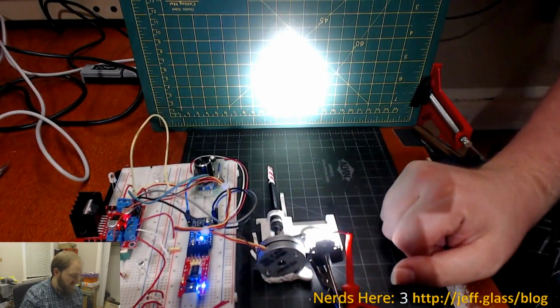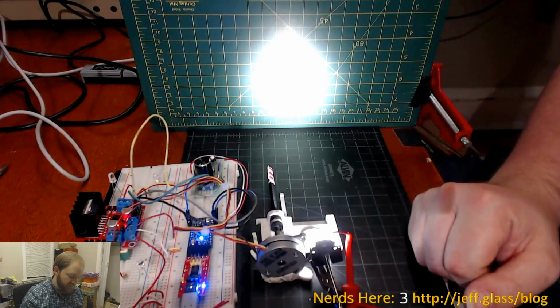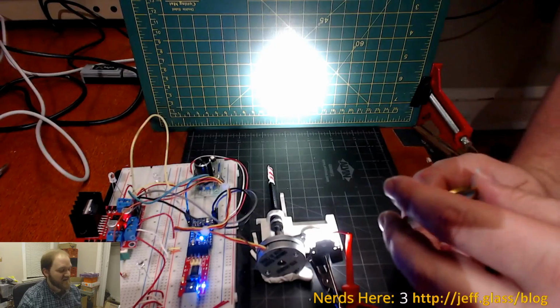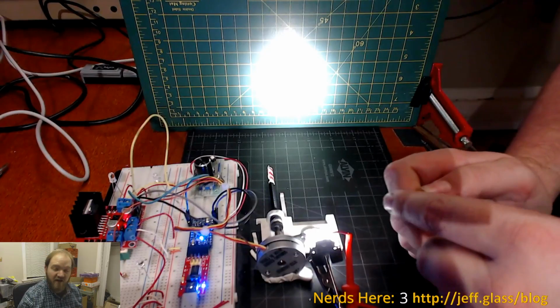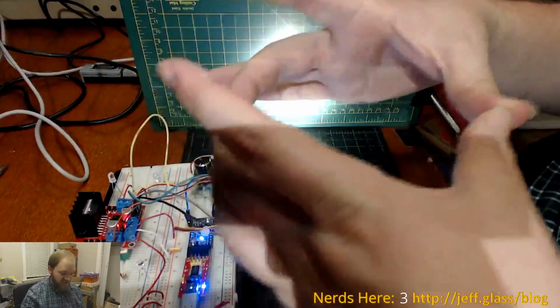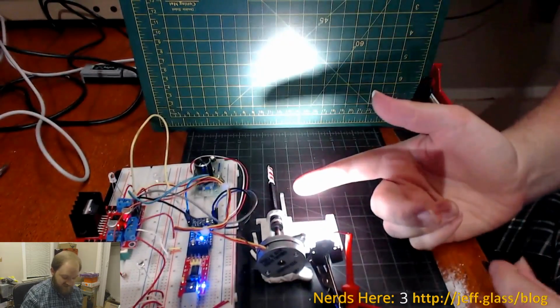So this is why whenever you see a Sharpy beam, or what other beam fixtures did we just strike? Like the Ayrton MagicDots, which are a super narrow beam fixture, they all have a relatively wide aperture, and that's just because their source is an LED chip of some kind.